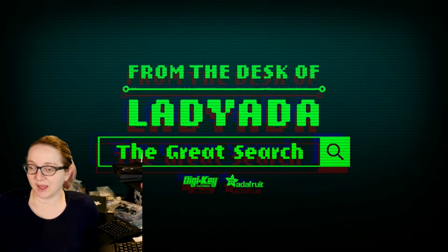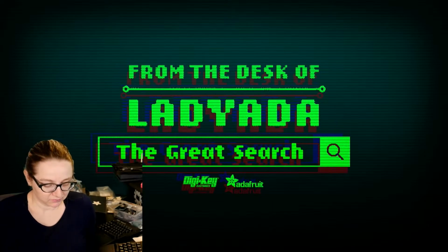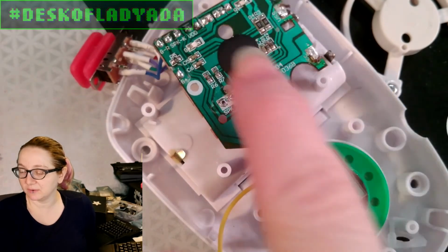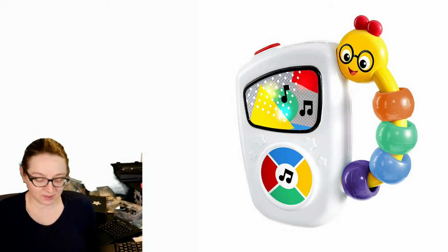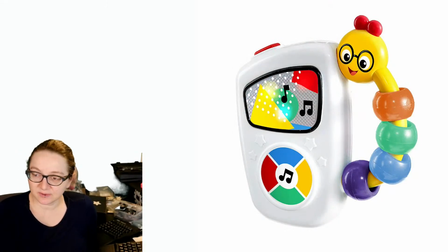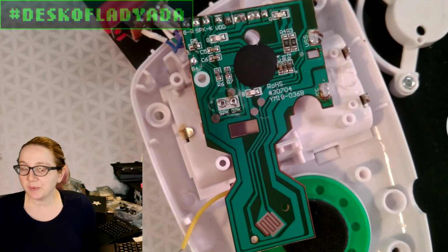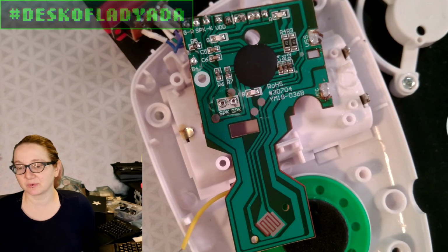Okay, this week I'm replacing this toy. Let's go to the overhead and I'll show the toy. We're redesigning this PCB to have a different microcontroller. By the way, that's the outside. I know I'm going to use a microcontroller or something, and basically none of the controllers I'm thinking of using have DACs, or they don't have DACs with DMA in them.